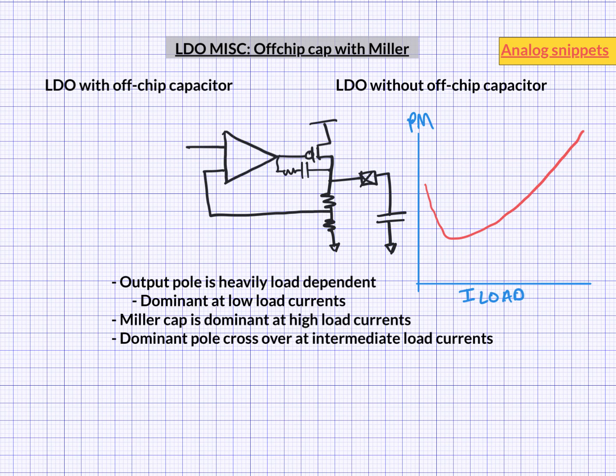But in this chimera topology we need to be very careful in finding the phase margin minima. We need to run stability analysis at multiple load currents, and the location of the minima will change with PVT corners, so we need a very exhaustive verification matrix. We also need to update the design itself. Recall that Miller multiplication depends on the gain across it, provided by the power PMOS, and as load current changes this gain also changes — in fact if load current increases the gain reduces. Typically more gain stages are introduced between the amplifier output and power stage PMOS, and since gain stages are typically inverting we may need to put two gain stages to preserve the overall inverting feedback.